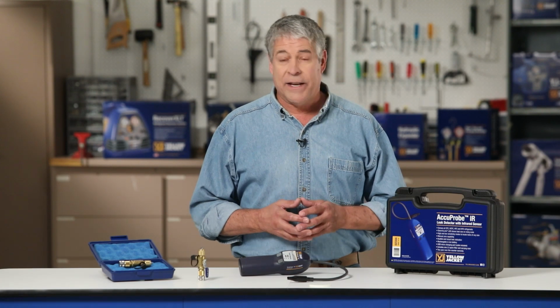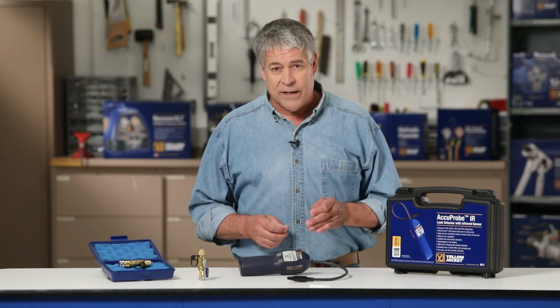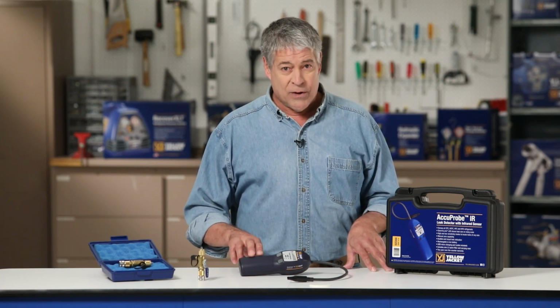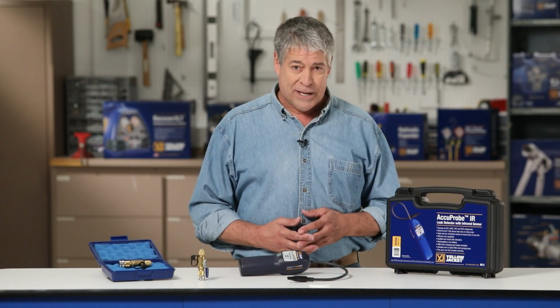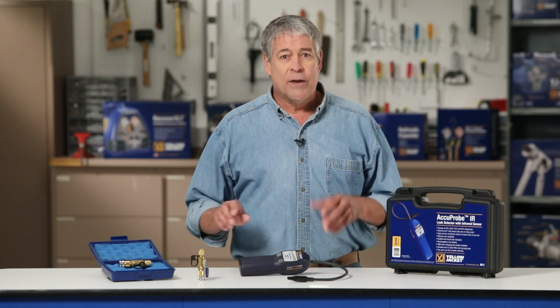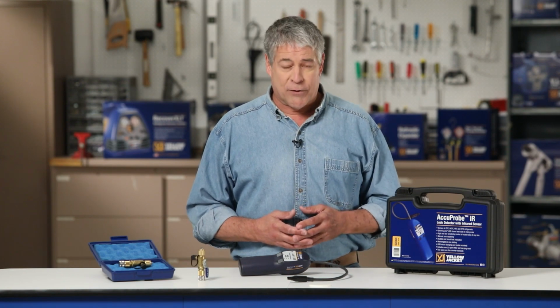Schrader valves are one of the most common places where leaks are found in HVAC and refrigeration systems. An improper tightening of the system's Schrader cores is one of the most likely causes of these leaks. In this video, we'll demonstrate how the Yellow Jacket 69320 AccuProbe IR leak detector finds a refrigerant leak. Then we'll show how the 18991 RealTorque core removal tool can be used for proper Schrader core installation.